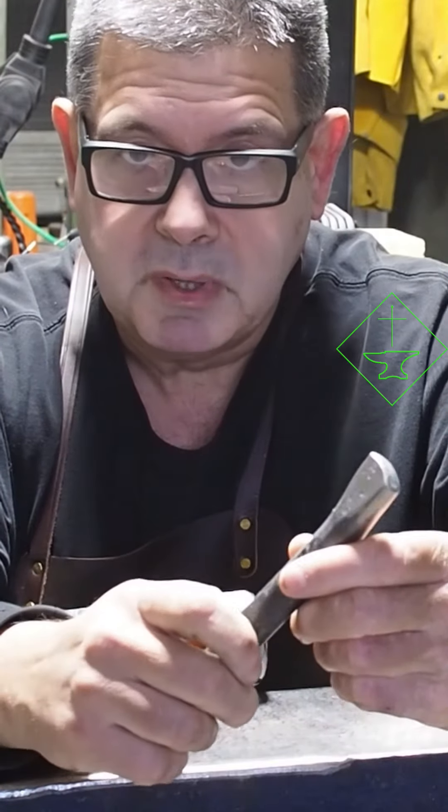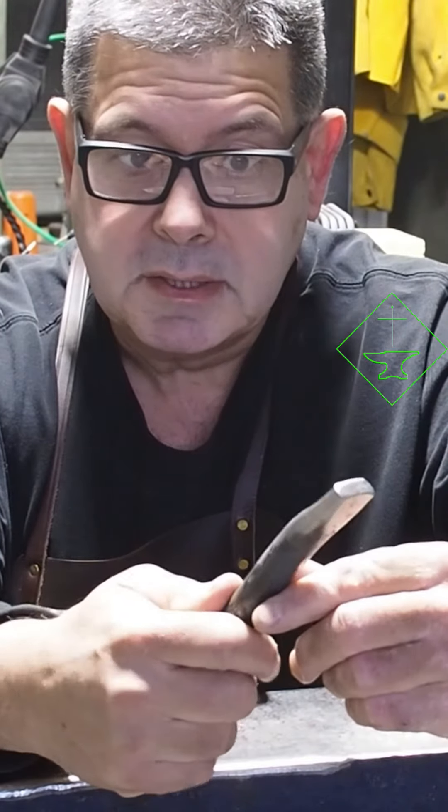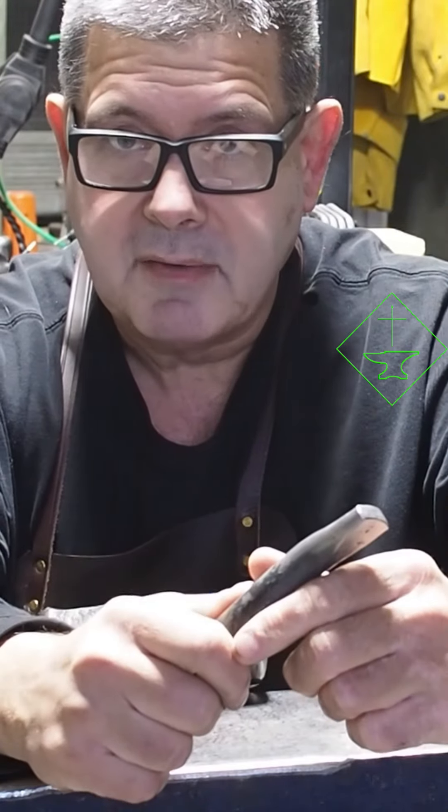So that's something you have to be aware of when you use an induction coil heater — it heats the outside of the bar too rapidly, anything thicker than a half inch.